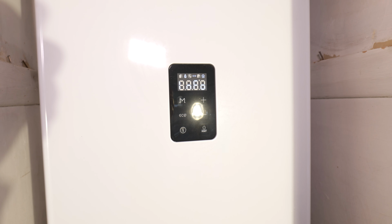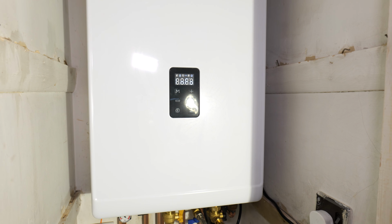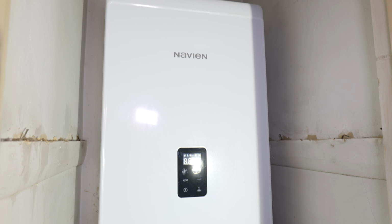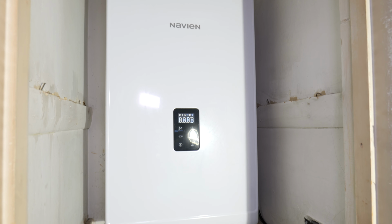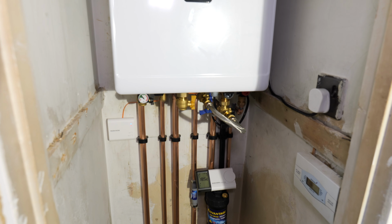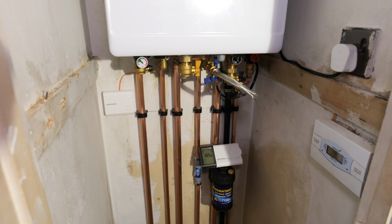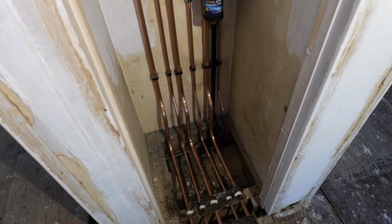This can be range rated. I believe it goes down to 4 kilowatts. But overall, it's been a good experience. Now, the flues are generic. They are exactly the same as the ones used on the Viessmann boilers, so I like using them, and they're no problem at all. You just can't put any screws through them. But overall, this combi conversion's gone pretty good, I would say.